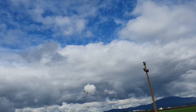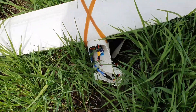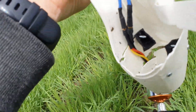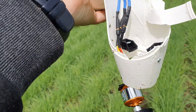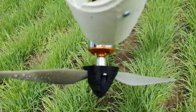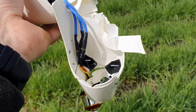Yeah, the whole motor is dangling. Okay, let's go see what happened. Unfortunately it didn't survive in one piece but I think it's fixable - yeah, the motor mount broke. It was flying so well, really really happy with this. There's a bit of damage. Maybe I should try without the spinner next - maybe it's causing the vibrations - or try to balance the prop better, although it looked balanced when I checked.